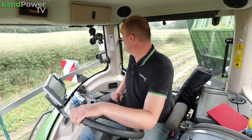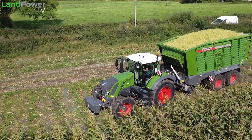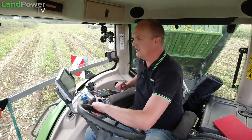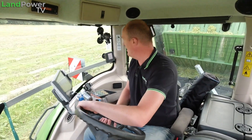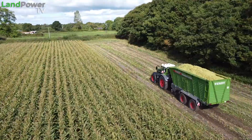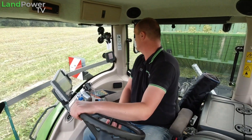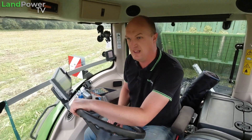Interestingly, my starting tyre temperature this morning — courtesy of the inbuilt sensors in the tyres — was 15 degrees C. It was quite a chilly morning, and now after doing a little bit of work, they are up to about 36 degrees. So interesting how tyre temperature changes. We're going to do a few loads with this setup and I'll report back on what this tractor and laden forage wagon is like at 1.4 bar — which, looking at my chart, is about 20 PSI.